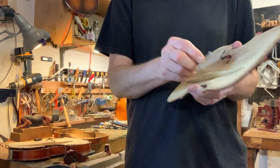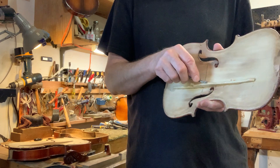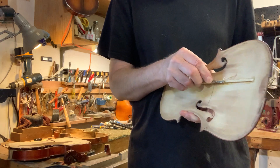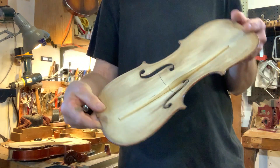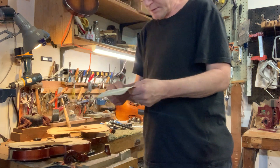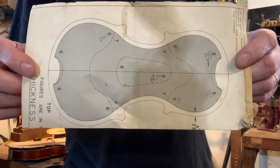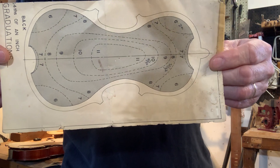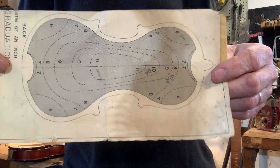Maybe a little bit smaller — it's a little high still. Anyway, that's kind of where we'll go with that. Finished sanding. The top itself is already re-graduated, as we showed you in the topographical top map — and make sure I correct myself from the last one: these are all in sixty-fourths. And here are the back measurements. So this is the top, which is less, and then the back is even more topographical — again all in sixty-fourths.